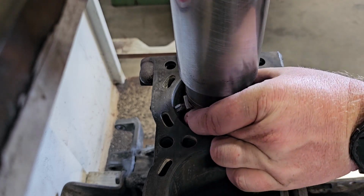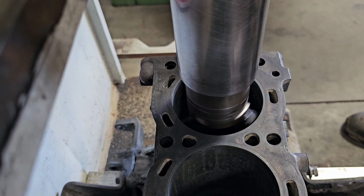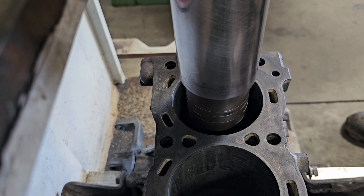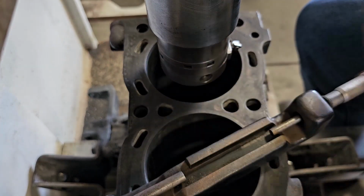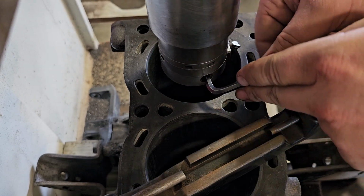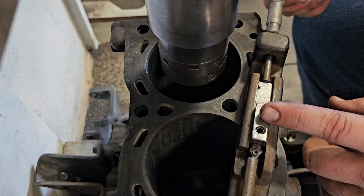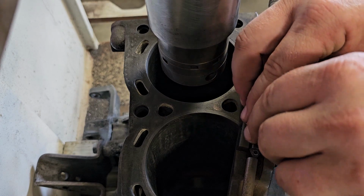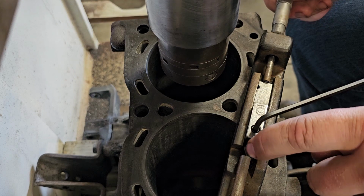It's not even, you know what, maybe it is touching. It just got a lot of taper. See, you can hear that it's just barely touching it. So we got to set the tool back out a little bit because it's just barely touching the bore. Take the tool out. Put it up against. So we're going to back this off, and I don't know, we'll just set it back 5 thousandths. I want to get a cut.